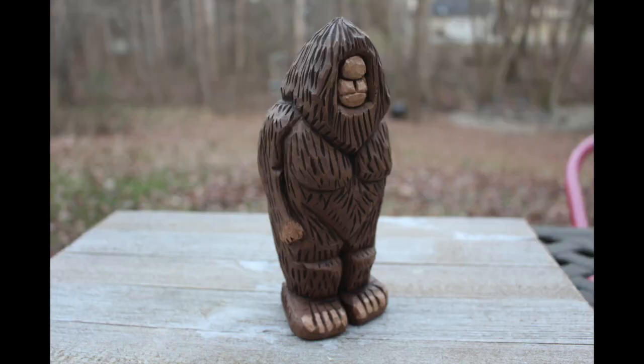I don't know that it's necessary to finish it any further beyond the wax. I didn't want mine to look really glossy, and I think the wax does a really good job as a final finish. Another thing you can do with acrylics — which I didn't do on this one — is dilute the paint with water to create a stain. When you do that, a little bit of the grain comes through and you don't get quite as dark a color. You just have to experiment with it. I recommend experimenting on scrap pieces of wood first to see how it's going to look before putting it on your carving.